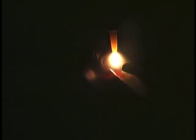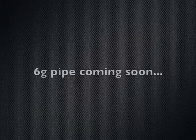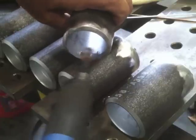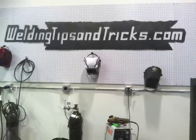So to review: about 90 to 95 amps uphill with a 7018 Excalibur rod — that worked pretty good. Then switched over to TIG welding at about 105 amps. All with the Everlast 160 STH. A good way to dip your toe in the water if you want to get started TIG welding. What's coming soon: 6G pipe test tips. I've got some 2-inch Schedule 80 coupons — we're going to do some TIG all the way and some TIG stick. Stay tuned, thank you very much.